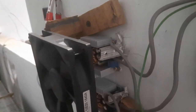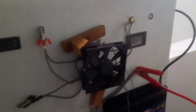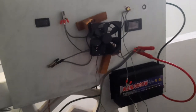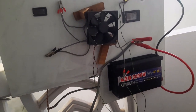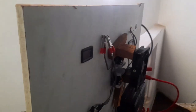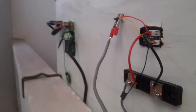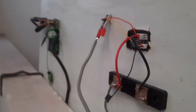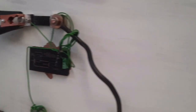As you can see I have placed two buck converters here. For now I'll be using one of these to power this cooling fan, so as soon as the current comes from my solar panel the fan will start working. Later I intend to add another solar panel to my system so this will come in handy. Here is the shunt connected to the meters — over here is the 100 amp shunt. And as you can see I have used thick wires which are connecting to the battery.